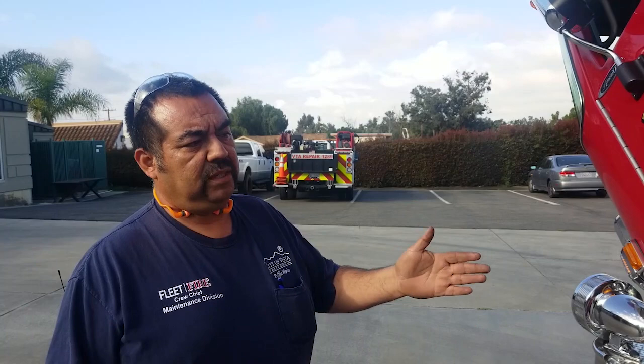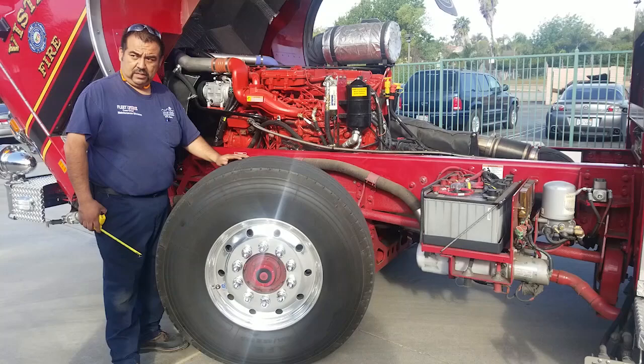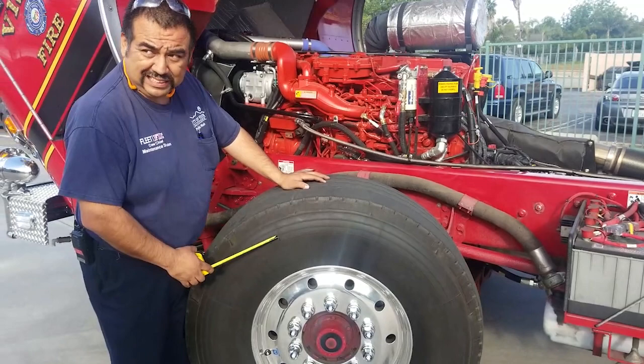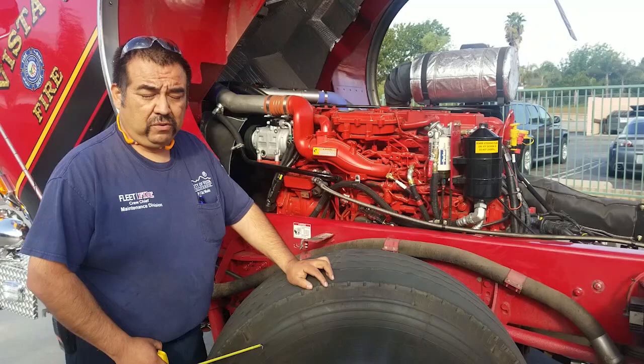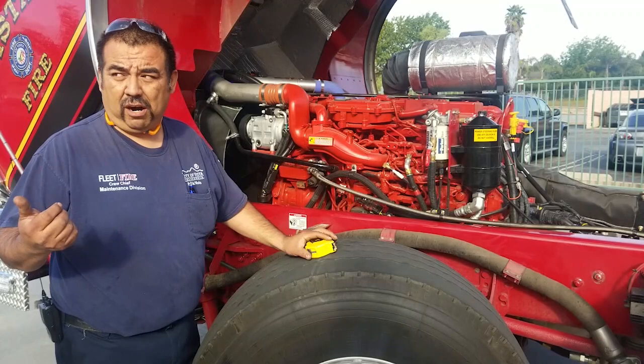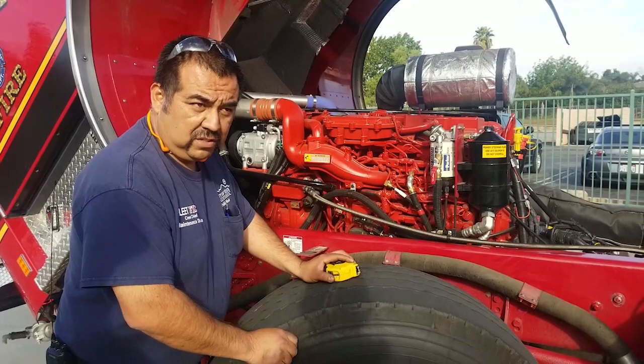The big ones are tires. Come to the tires — do you have any damage to the side of the tire, the top of the tread, or inside part of the tire? Any cut in the sidewall with significant depth where you can feel or see cord is automatic out of service. Any cut that's gouged enough, we don't play with it — it's an automatic out of service. If it's relatively low, you can see it but can't see cords, take a blunt screwdriver and run it in there to make sure you can't touch cords. If it's really deep, even if you can't see or feel a cord, if it's significant, it's usually out of service.